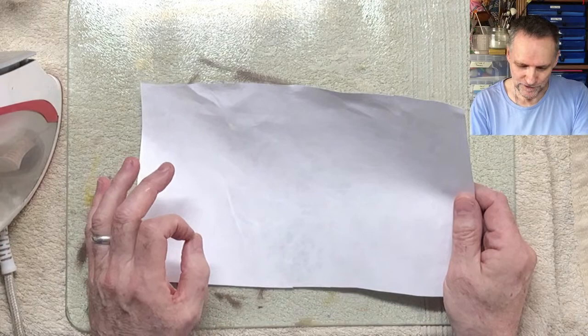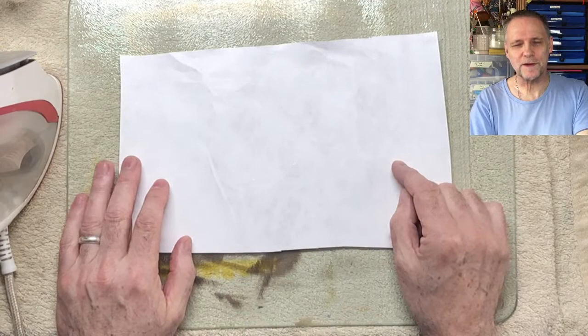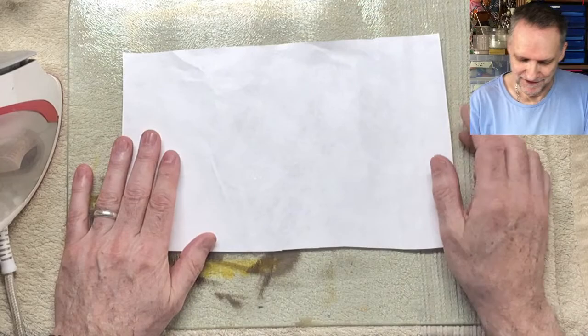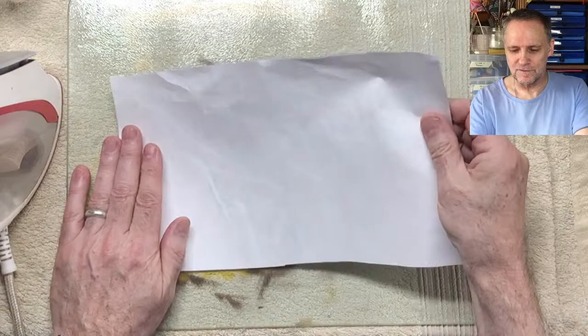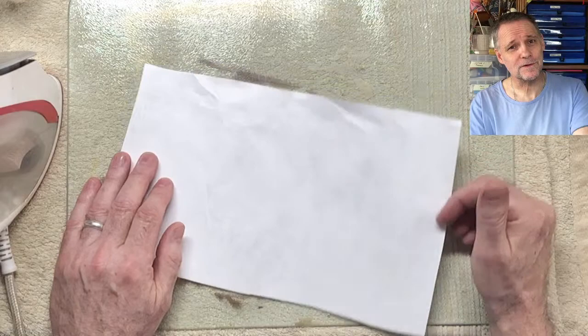So whilst it won't let liquid water through, it will let vaporised water through, which if you're wearing one of those painter's suits all day is a good thing to know, because it wouldn't be nice when you take it off if you'd been sweating all day and it couldn't get out. You'd have big sloshy legs. Other reasons they use it: it doesn't rot. It's antibacterial, so mould doesn't grow on it. So they wrap your house in it, so it keeps the weather out, but allows the house to breathe.